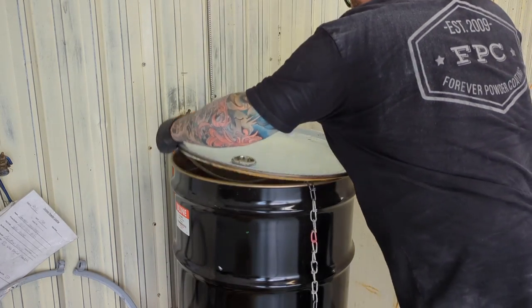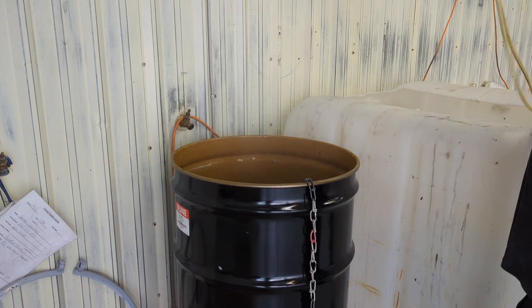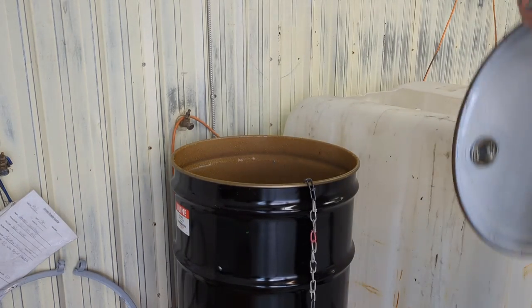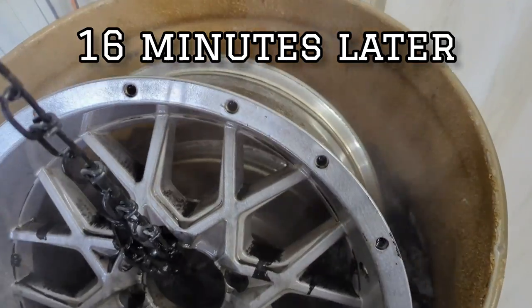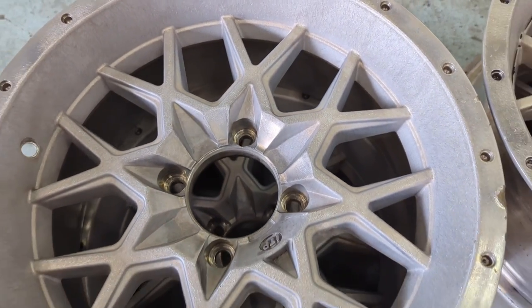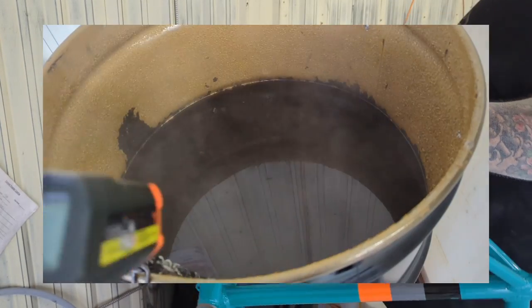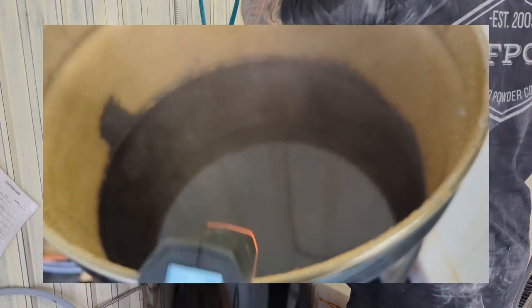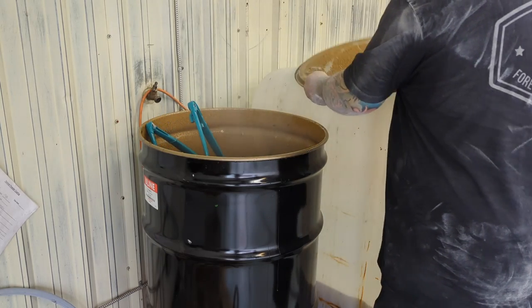Outside of the drum you're going to be stripping parts in, you're going to need a drum heater like this one. I've linked one in the description directly from PowderStrip's site. These are typically available at various outlets online — you can get them directly from them or go find them online. This is called a band heater. That's to heat the product because EcoStrip does need heat to work effectively. It does work without heat, but it takes a lot longer, and I'm told it can actually break down the product using it unheated. I've only ever tested it heated. There's some varying opinion on what temp is best, but I've found that 150°F will take off pretty much anything. If you have heavy epoxy primers like the ones found on European wheels, it does take a bit longer — you can up your temperature to lower your overall immersion time for epoxy-based primer.